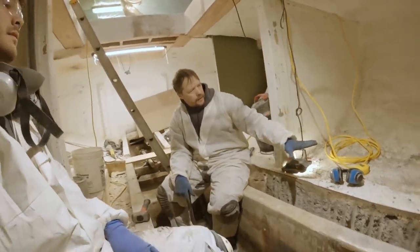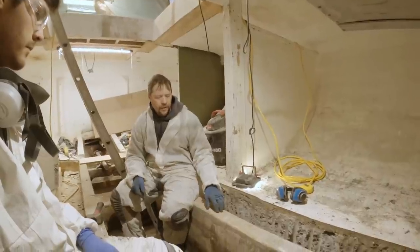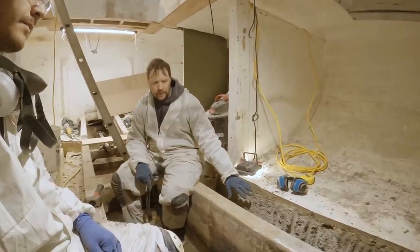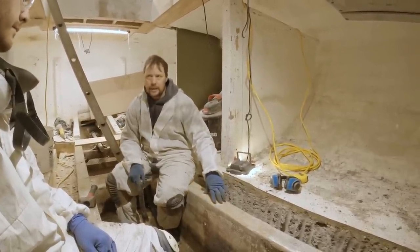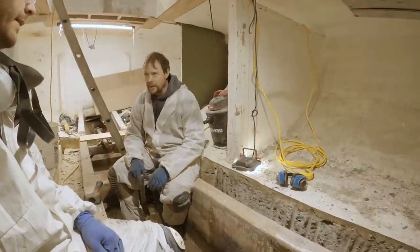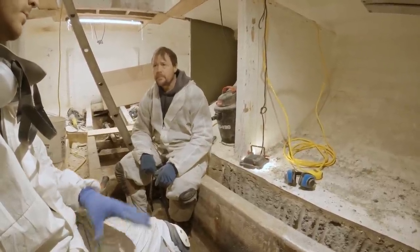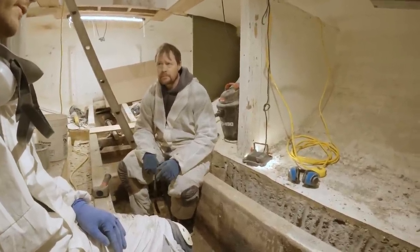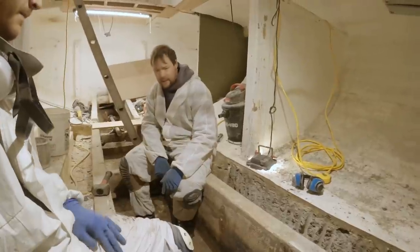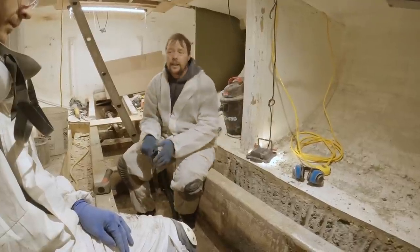At some point we will be replacing all the foam and all the fiberglass in here, but it's going to be hard to come back in here and do that then. We're going to have brand new shaft alley covers and brand new sumps going in. All that stuff would have to be removed to replace these, and it doesn't make sense to risk damaging those trying to remove them and reuse them. Removing something to save it takes a lot more time than destructive removal. And right now we have the shaft out of here, so access is easy. That shaft would have to be pulled out again in order to get in here and jackhammer this concrete away, because it has to be knocked out to get down to it.